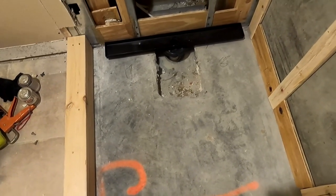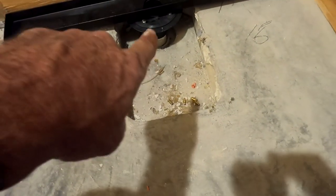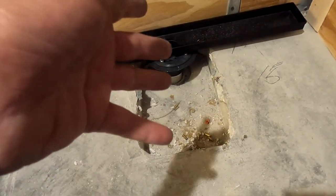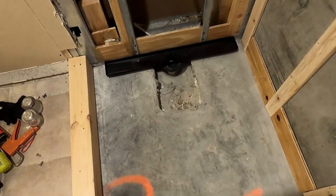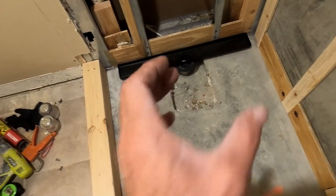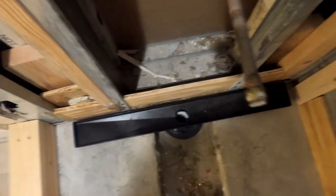You've got to come up with solutions. Especially the way I configured this drain with the double hubs — you're not going to read that in a book. You just have to go to Home Depot, get a bunch of parts, and start figuring it out on your own, because usually there are three or four different solutions. In a condo, in this case, there's really only going to be one. You could argue you could put a commercial drain in there, but still — you're relegated to one end and a commercial drain is typically round or square, which wouldn't fit because you're so far up against the wall.